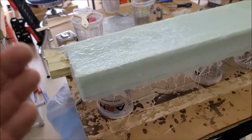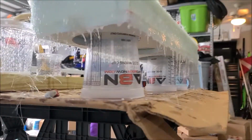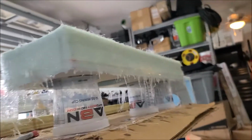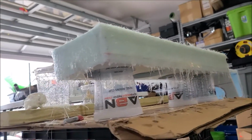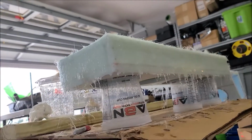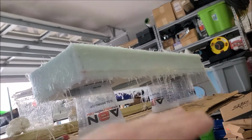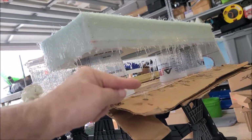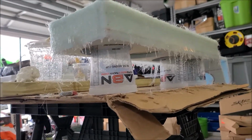It is actually in the orientation that it will be used right now. I'm waiting for the epoxy to get a little bit drier, and then I'm gonna tuck in the seams on the edges. It's not buttoned up against it yet, but we will have all of what we need as far as I need epoxy and fiberglass to be right to the edge, and then I'll flip it over when it's dry and then lay the cloth down all the way across, and then on the sides get her sanded down, finish it with something.